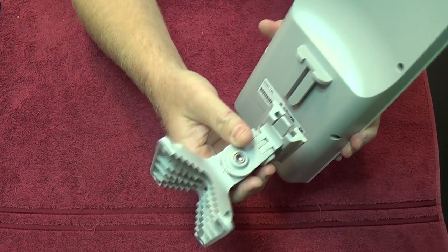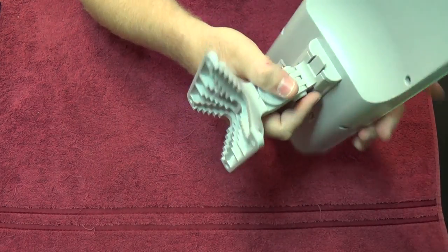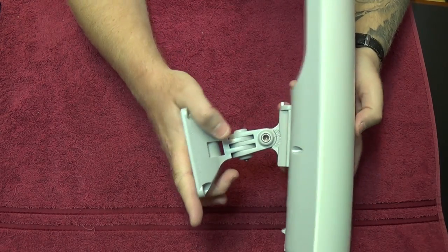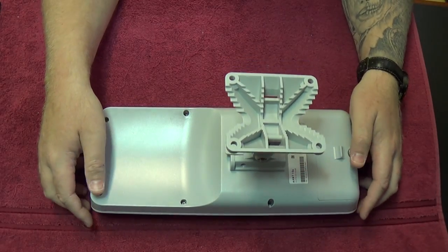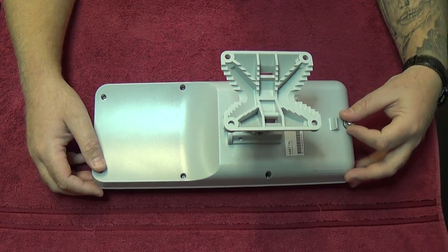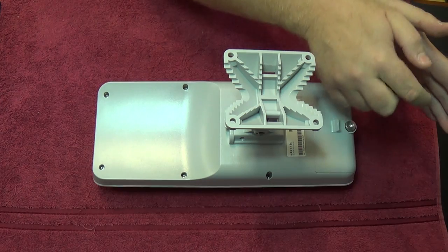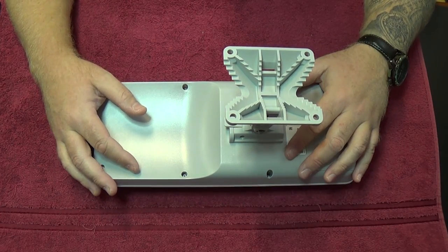The antenna bracket can be fitted and you simply slide it down — it's got a clip and it clips into place. There you would have your sector antenna mounted onto the pole, and you can adjust your angles downward to whatever area you want to cover. This is a 120 degree sector antenna — a nice angle because you can cover a wider area. By using three or four of these you can cover a 360 degree area. With three you'll have dead zones where the antenna beams edge out and balloon, so it's always better to have four for slightly better coverage and sector overlap.